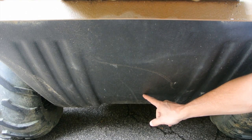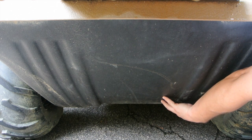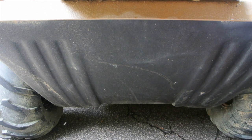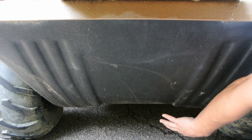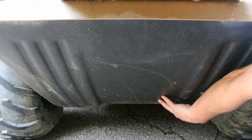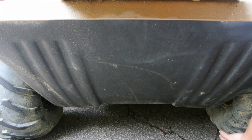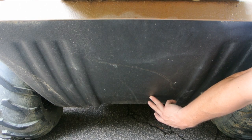And this hull is also its skid plate. The polymer is so tough and flexible that it allows the 700-pound Max to float right over the top of rocks without any kind of damage. In fact, it's really hard to find a Max that has ever cracked the hull if it was taken care of. But even if you do, it's a simple matter of welding up the crack with a soldering iron and some plastic filler that you can get from discarded plastic items you might even have in your home.